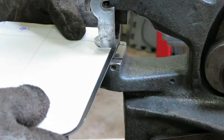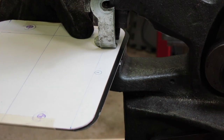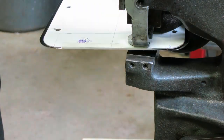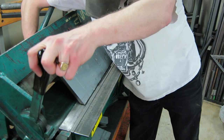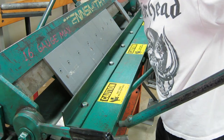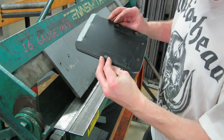I'm going to take my little cardboard template, tape it onto the piece of sheet metal, and punch out with a hole punch the holes that the compressor gets mounted onto and the holes that get mounted onto the tank. Here's a quick look at the template before the edges get bent. I clamp it into the brake press and bend up the edges — that's going to give me some strength on this sheet metal part, keeping it thin and light but giving me that strength to support the compressor.